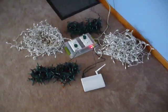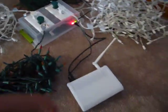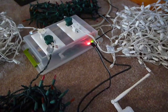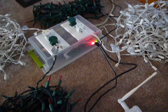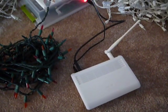Here's just the up-close shot of the build. As you can see, we've got four different outlets that are all independently controlled. We've got a wireless access point going into the box via USB, and inside the box is 110 power going into the wall. Each one is going through a separately switched relay board, which is being controlled by the wireless access point.